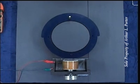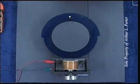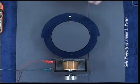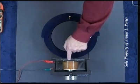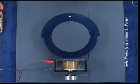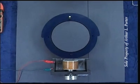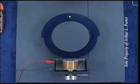For this size coil combined with this size magnet, it takes 36 volts for the magnetism to completely neutralize, or simply have no effect at the face of the electromagnet. Now I'm going to turn the power on to the electromagnet, and you can note the increase in intensity of the magnetism, but we'll still have the magnetic lockup.